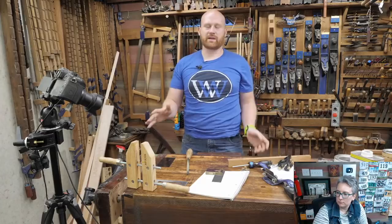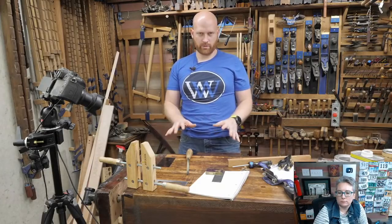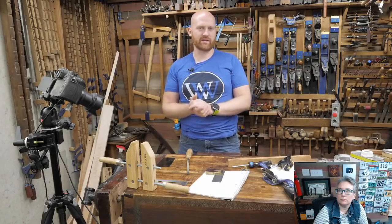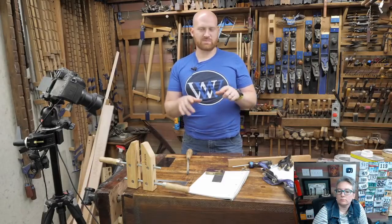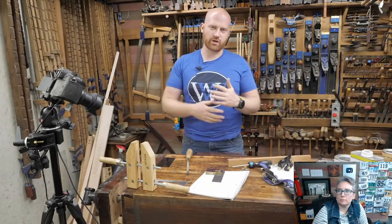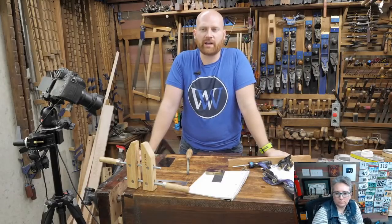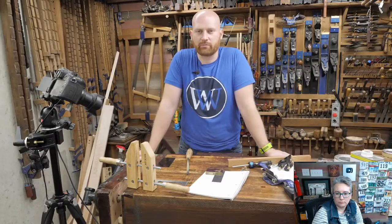An honest opinion, the perfect wood for a bench would be something like a soft maple, a red maple, a silver maple, something like that. It's soft enough that it's probably going to dent before your work does, but yet it's still stout enough that you don't have much vibration in it. It's relatively easy to work with. That would be my best lumber if you could get a soft maple.